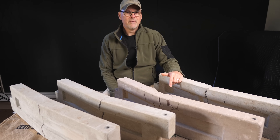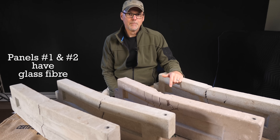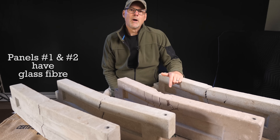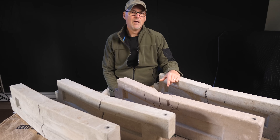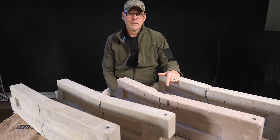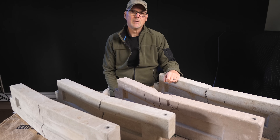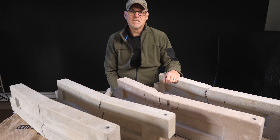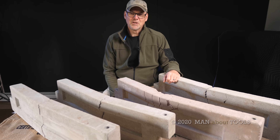I don't think I have enough evidence to say if the added glass fiber made any difference here — panels 1 and 2 had fiber added. So to summarize: adding a double layer of mesh greatly improves the tensile strength of AirCrete panels; adding perlite to AirCrete appears to make the panels weaker under tension; and glass fiber — not enough tests to say just yet. I hope this was helpful — drop me a comment with your thoughts. In Part 1 I received some excellent suggestions and I'd like to thank everyone who contributed. In the next video I'll do a quick test of some CSA concrete panels I made in Part 4 of the Garden Box series. Thanks for watching and we'll see you soon.